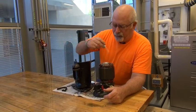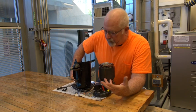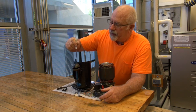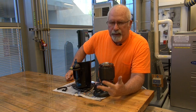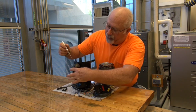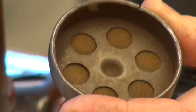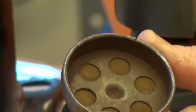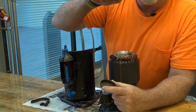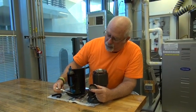Normally these type of small rotary compressors are in your window units and freezers and things like this. If your coils get dirty and refrigerant doesn't come in as a low-pressure, low-temperature superheated gas, liquid is coming back in. This screen — which you can see has very fine, minute, tiny holes in it — takes those droplets of refrigerant and, because of the pressure, shoves it through there and it evaporates. So what it's really doing is ensuring that only vapor comes through that line.